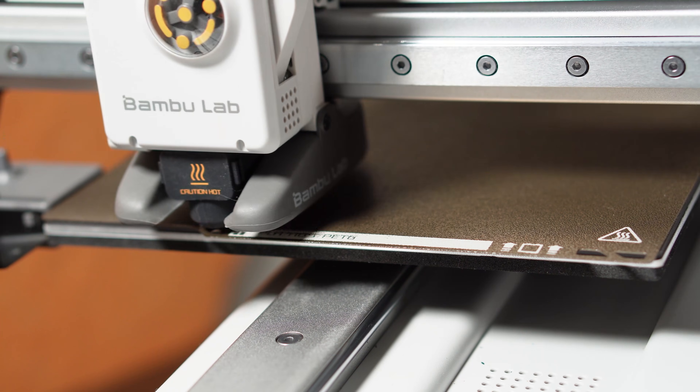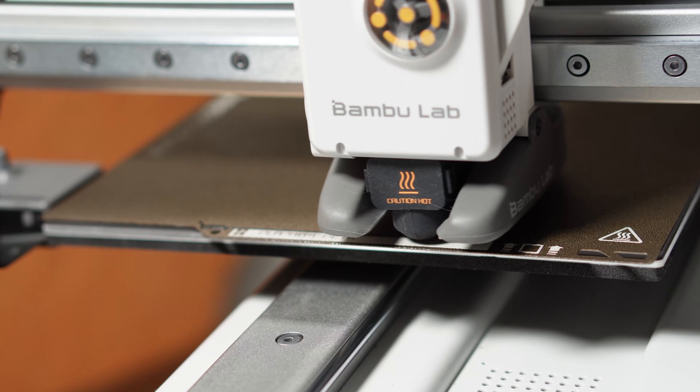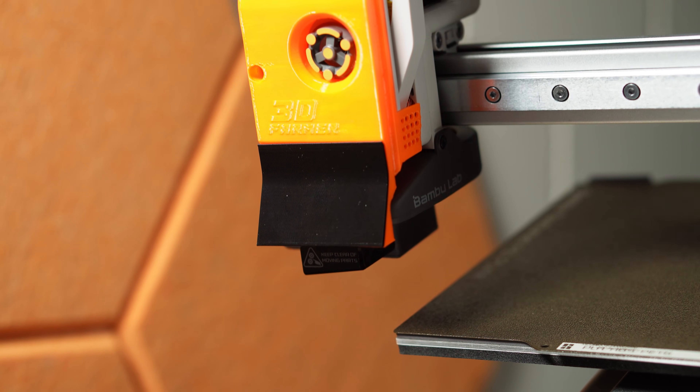On to the software part of the Farm Loop system — here we had to get very creative. First of all, we had to get rid of the purge line; otherwise, that line would become a mess after 60 prints. So instead of purging onto the plate, it now purges into the purge chute. After the part is printed, there are two options: either wait until the bed reaches a specific plate temperature, or until a specific time has passed. The temperature method works best, but in case you have a hot environment or cannot wait that long, you can also set a timer.